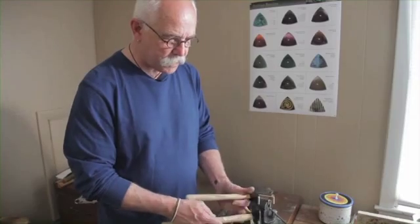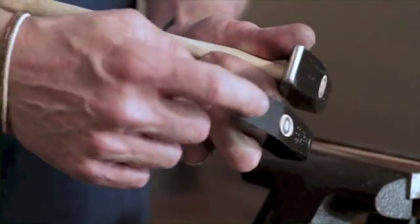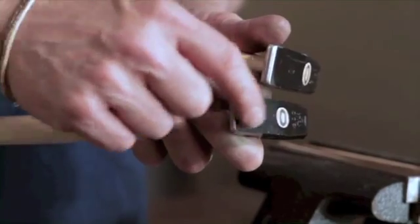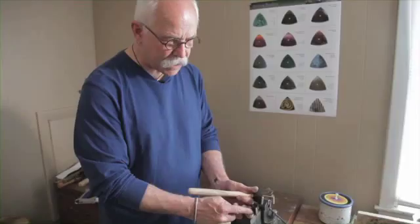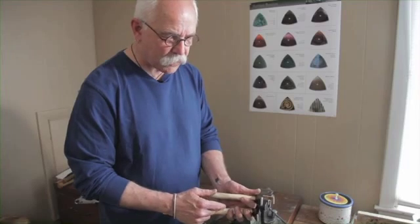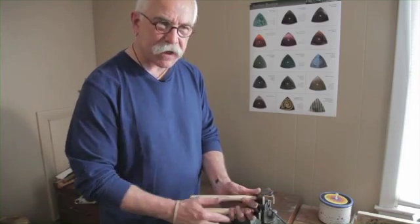On the other end, on the cross-peen, the store-bought version is quite sharp. This curve is often pretty good — sometimes you'll see a flat there. To the naked eye you think it's a wedge shape, but when you look closely, it's flat. This one is in good shape that way, but it's quite sharp on the edges, and that can cause problems — it'll cause marks that I don't want. And again, it is matte with some lines in it, and we want to take it down to a polish.